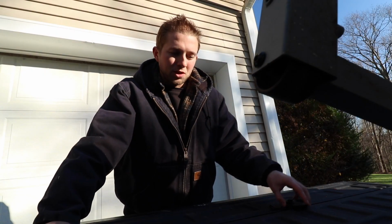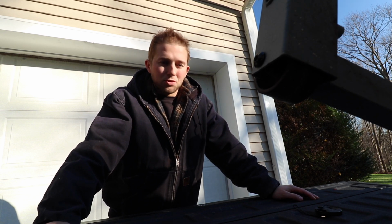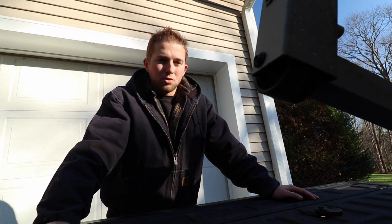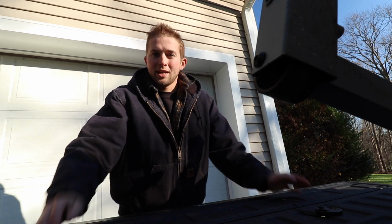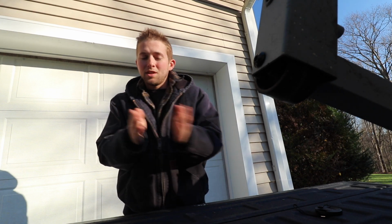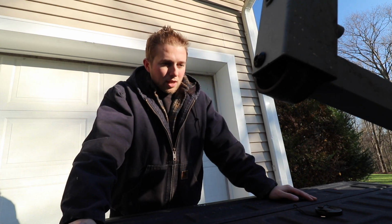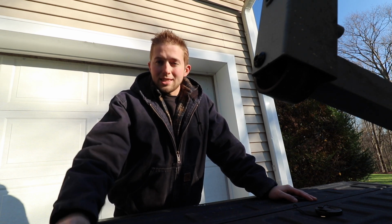Why am I replacing the fireplace? Well, the two fireplaces in this house, well, there's one of them now, are what's called zero clearance fireplaces, and they're original to the house. Zero clearance meaning that there is zero clearance required between the fireplace itself and combustible materials. The problem with these fireplaces is that they put off no heat.